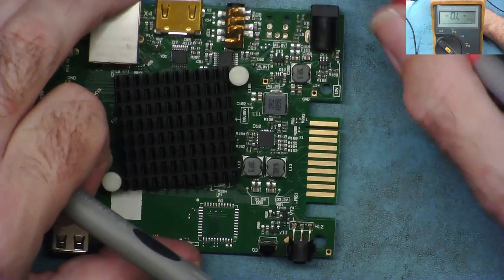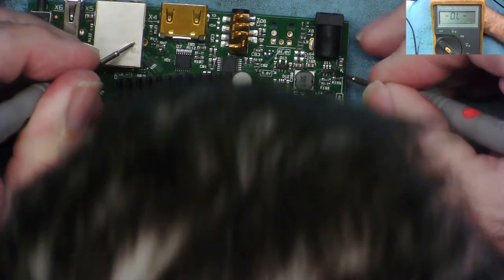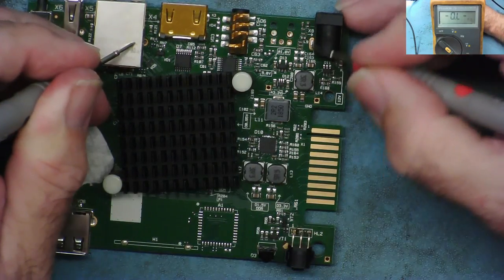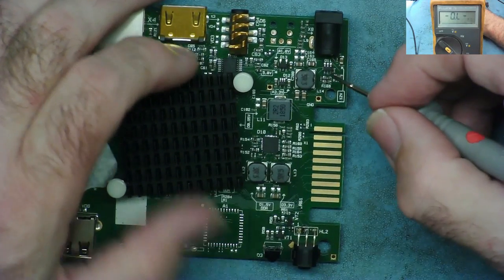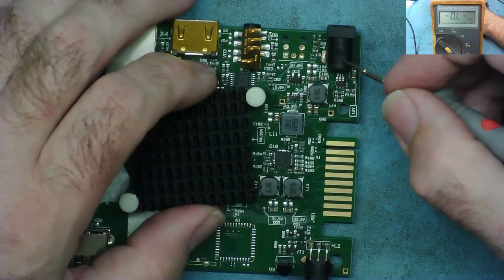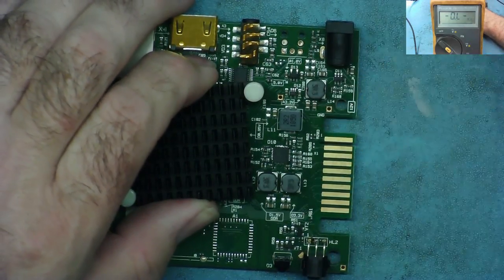And somewhere we've got a short circuit on the input. So the chances are it's going to be one of these chips or a capacitor around here. Because I've got no short on the outputs, I might just try putting voltage in from my bench power supply and see what gets warm. But just before we do that, let's have a quick look at these chips. Let's even find a data sheet for these and we can see what you've actually got here.